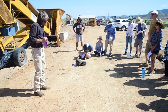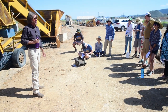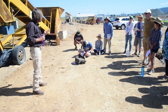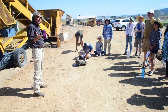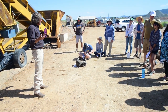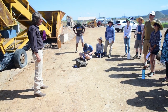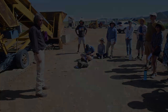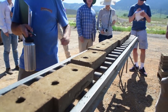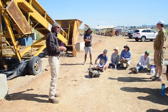But there's thousands and thousands of buildings around the world that have been there for thousands of years that are unstabilized blocks. So it can be done. And then the other thing, if you're building in developing nations where they don't have any money, again, the cement is the expensive ingredient, so you could skip it, save some money. Why not take the blocks right out of the machine and put them in the wall? Mm-hmm. Sounds like a real smart thing to do, because you'd save setting them down and picking them up, and it's a lot of labor, right?